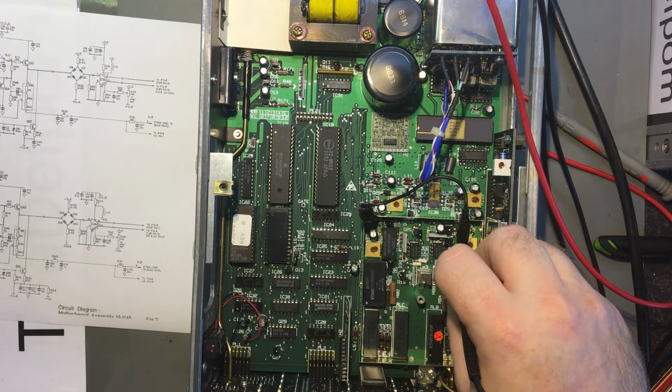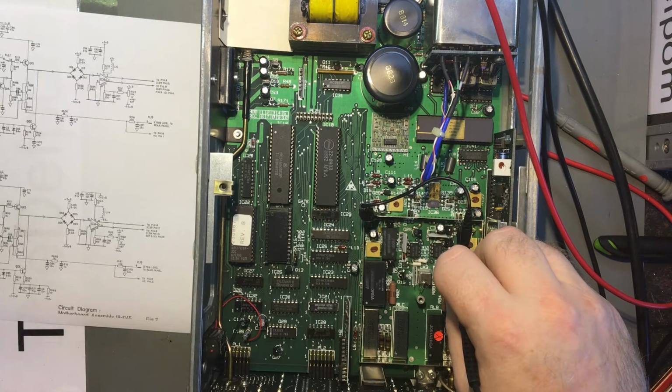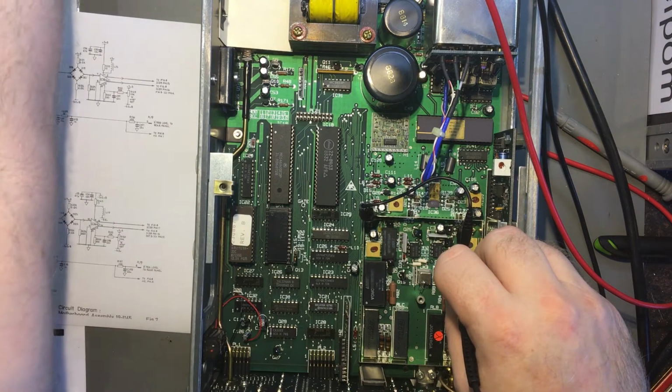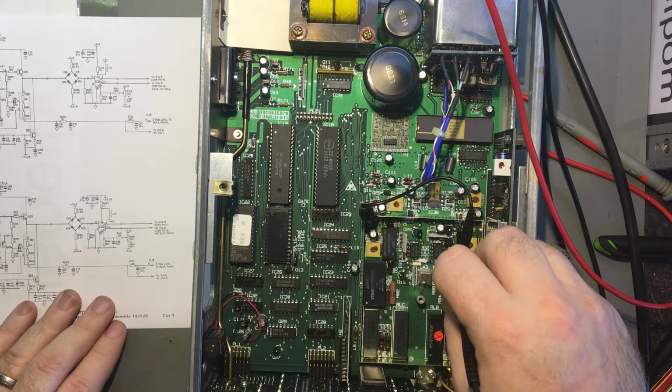Now this is different. That's approximately 1 volt, but with 3.5 volt deviation, or standard deviation, right? So it's interesting. And what's more interesting is that frequency doesn't measure the same either. Oh, there we go. Now I've got my triggering right. But yeah, that's different, and it shouldn't be different. They should be basically the same.